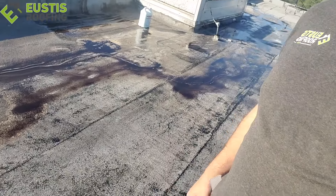It's also important that you have a good candidate for a roof coating. You can't coat every roof. A lot of guys like to, but you can't have a premium roof coating if you don't have a decent roof that's going to be able to adhere to. And you need good water flow. So this roof here, it's got good slope. The water's coming off the roof.